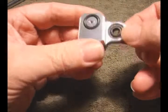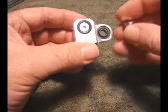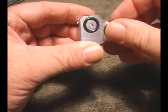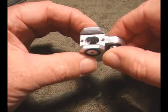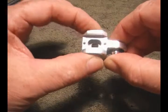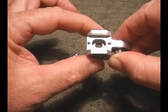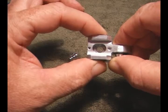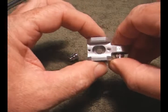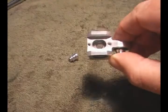We've got this unusual mounting system here, which is like a mini swash. It's a ball joint basically there, and these aluminium holders which attach to the frame are going to go into this ball joint here and give it the capability of having some lateral movement, which is a very clever feature, and that's going to allow the frames to twist a little bit, as they inevitably do, without binding on the starter shaft on here, and thence taking away power from the engine. No idea how much difference this is going to make, but it's a very novel feature, and as far as I know, unique to the Kasama design.